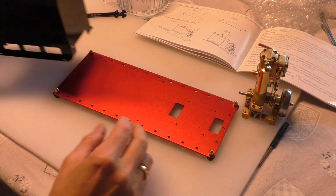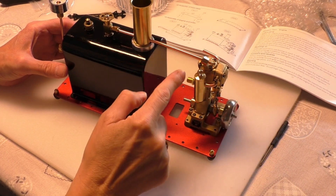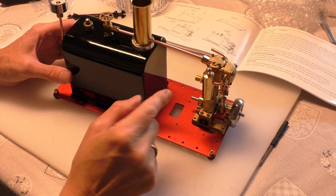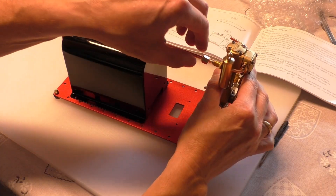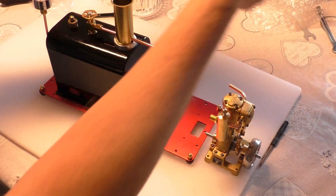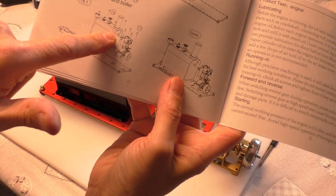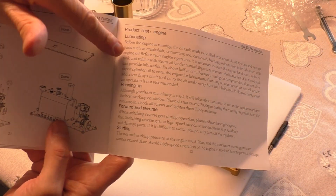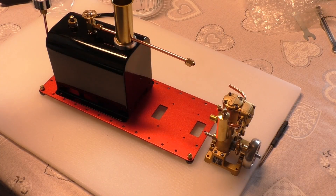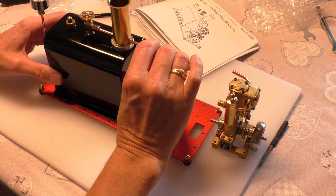Just coming to mount the boiler assembly and the engine on the base, and there's one thing that it doesn't explain in the instructions — the steam feed pipe. You're going to have to bend that to get it to line up. I've had these in the past when they're pre-bent and you have to make sure this is exactly square, otherwise you risk cross-threading. I'm a little disappointed because I followed the instructions and then when you turn the page the next picture shows the pipe pre-bent, but there are no instructions or advice on bending that copper pipe.